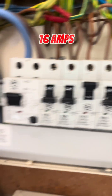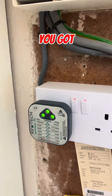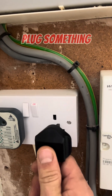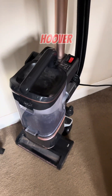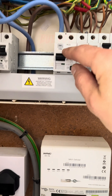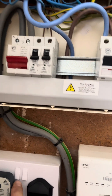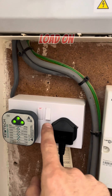So this is more than likely what the problem is. You've installed your new socket — 16 amps for a 2.5mm cable — and yes, you've got live, neutral, and earth. It's spot on. But as soon as you plug something into it, say a hoover, the RCD trips. You reset the RCD and you've still got live, neutral, and earth — it's just when you put a load on the circuit.